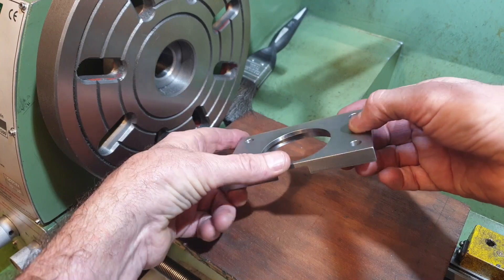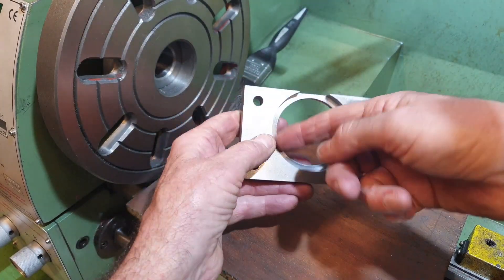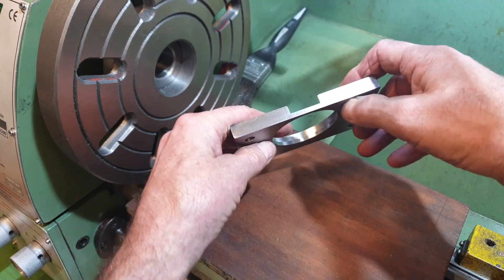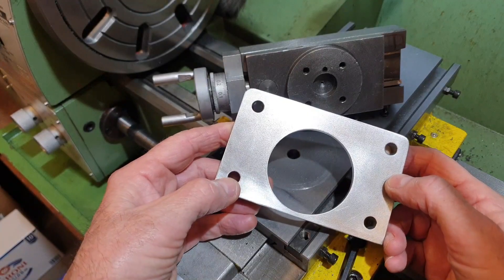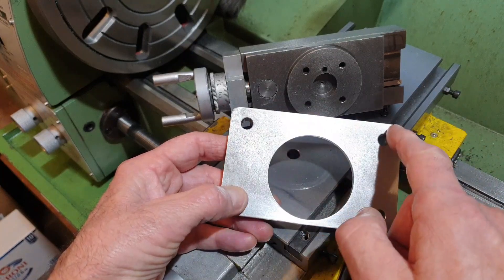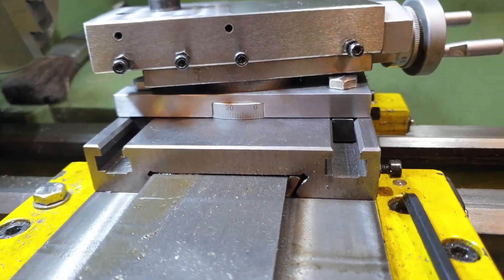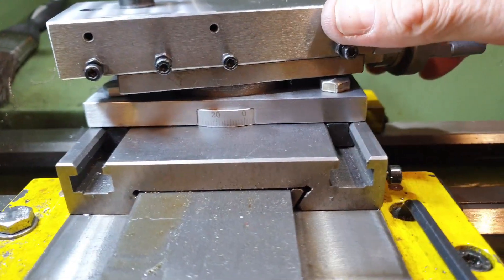I did chatter a bit but I actually took a little bit more off on the counterbore diameter on the way back out. I've deburred it — there were quite a few sharp edges, particularly on the window. I've also given it a clean up. There are some jaw marks where it was clamped in an earlier attempt in the four jaw, but I think that's worked very well. When I first put it all back together I noticed the screw gauge was just catching on the two rear corners of the new bracket, so I simply rounded those corners off with a file. Now the scale on the base of the compound slide is still visible through the window, allowing us to crudely set the angle of the compound slide.